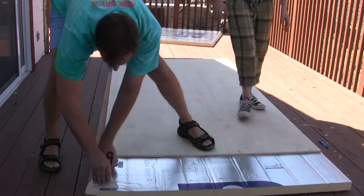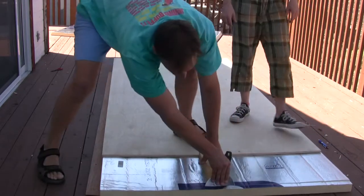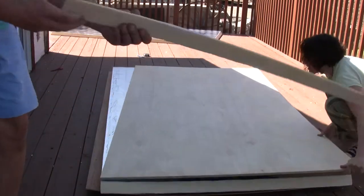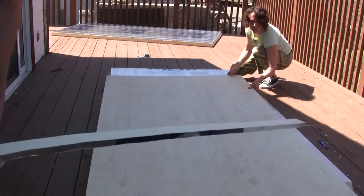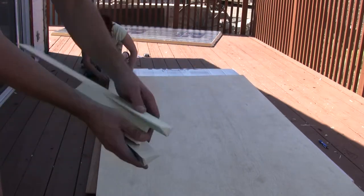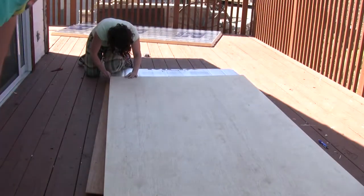Sometimes you don't go all the way through — usually it goes all the way through and you just pop it up. Try not to go too far down. Then we take it off and you're left with a beautiful angle. Tight, clean, fast. Very, very little excess waste. And while I'm crumpling this up into the trash can, Ellie here is actually setting up the next line. You take these little pieces and just break them up and get them out of your way — we don't want to become moop. There's enough material out of place here we're going to have to clean up, but this does keep it to a minimum.